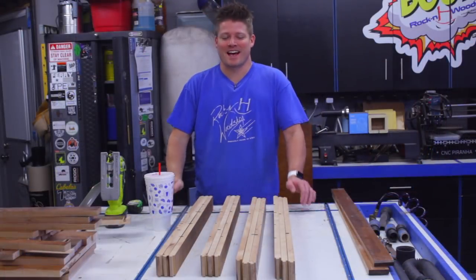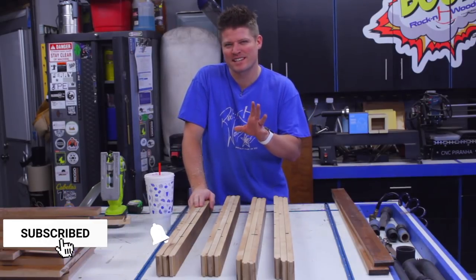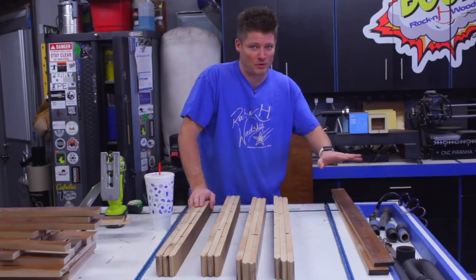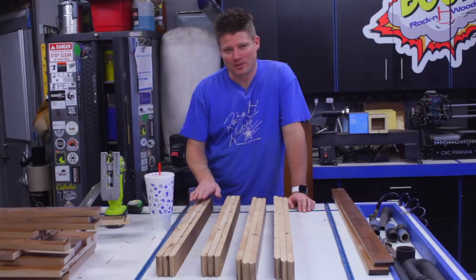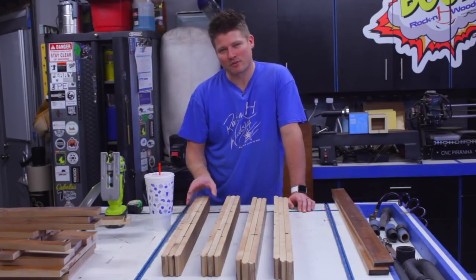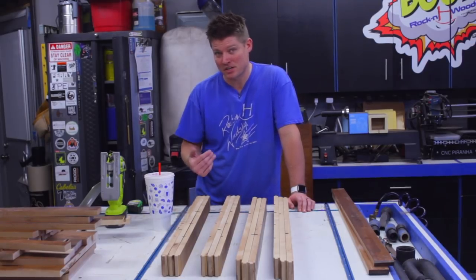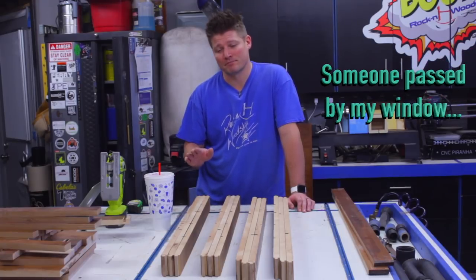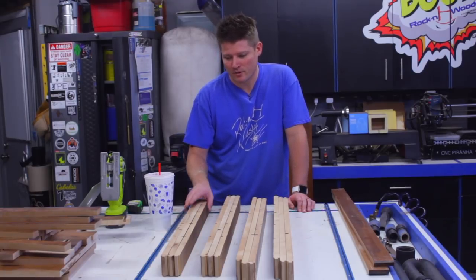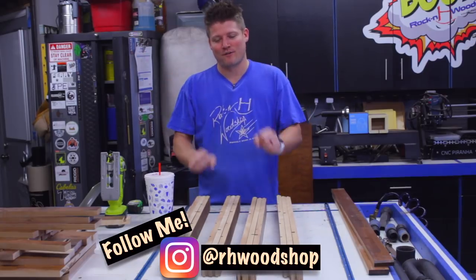All right, good news. After cutting these up, what I did before I cut is I changed my overall measurement for the oversized measurement by an eighth of an inch, and that saved me quite a bit over the course of both those boards. So after putting these together, I have four legs, and the thickness this way, after I run them through the sander, will just be right at around 2 1/4, because I don't plan on taking much off. If anything, just to rough up the finish is about all. And then after I get them glued up and then trim them down, they'll be perfect. So luckily, yes, I was able to get all four legs.